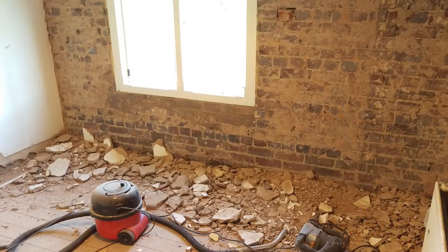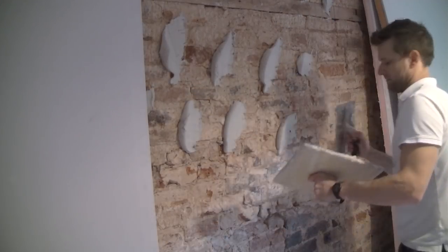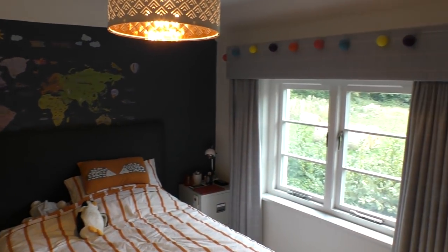As I think I might have said on some of my videos, I'm gradually refurbishing this house room by room. In the bedrooms upstairs what we've been doing is reducing them back to the brickwork and insulating the walls with thermally insulated plasterboard — Kingspan K17, I think it's called K118 now. This room in particular was very badly beset by mould that used to form on the walls in the winter because of condensation, and what the thermal insulation has done has basically eliminated the mould on the walls. It's been absolutely fantastic. When we finished the room we were left with a really lovely room that we're really pleased with.